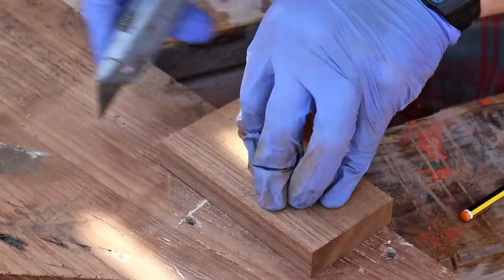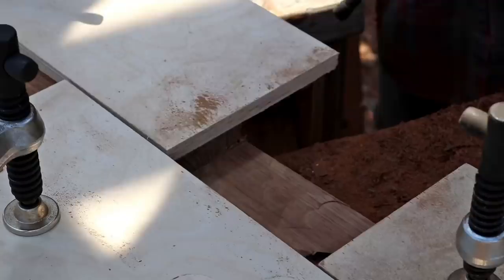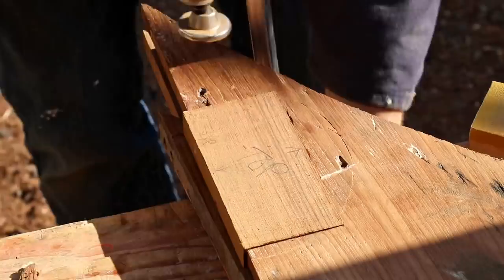The brand is really irrelevant. It's polyurethane glue. Lots of different people make them, but I've always had good luck with it in the past, and I've found it's lasted well and been very strong. It is fully waterproof. It is used a lot in boat building. Polyurethane is not structurally gap filling, but as long as your plugs or your graving pieces are nice and tight and you have a good wood-to-wood connection, then there's no need for it to be structurally gap filling.